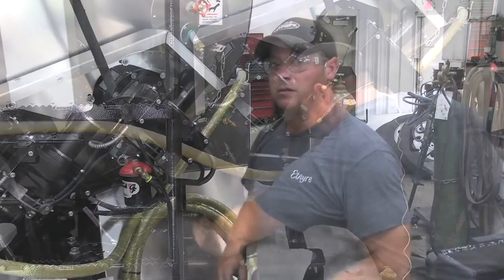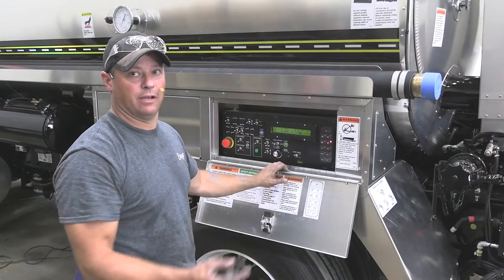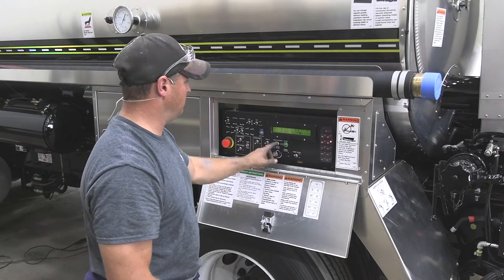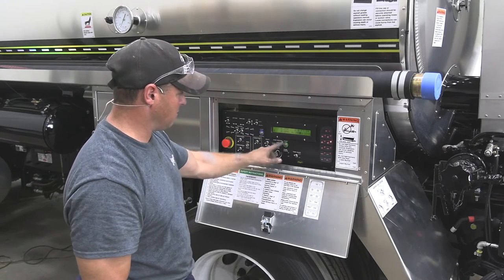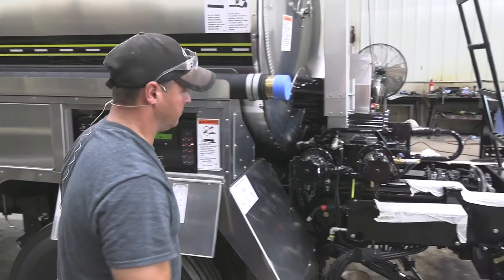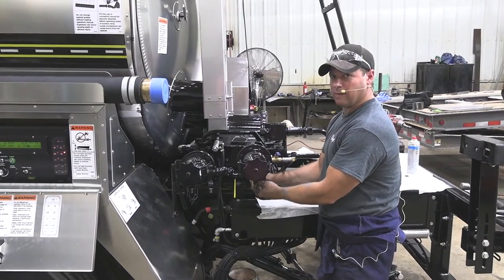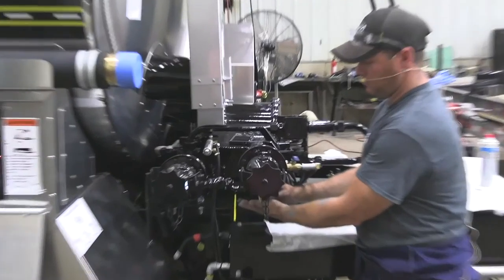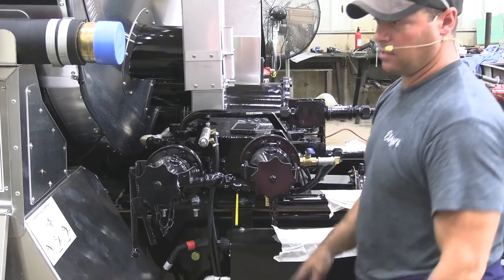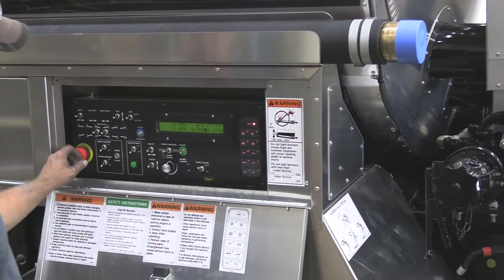And so the next thing to do would be to turn your valves back on up front to the open positions. All right, so the last thing I would do is check vacuum on the pump. Just put it in bar suck back mode, put it in the manual mode, hit the auto start button, and then turn your pump up. Crack the bleeder valve here. Just make sure you've got vacuum here. We've got plenty of vacuum, we're good. Shut that off and pump off, go back to the home position and shut her down.